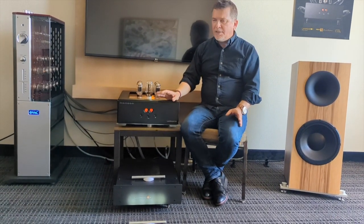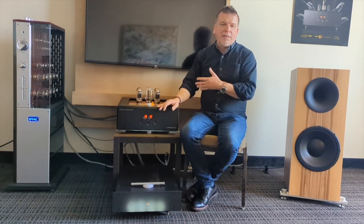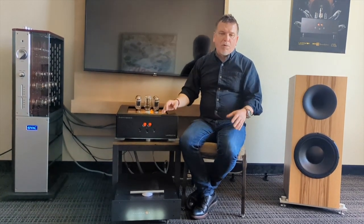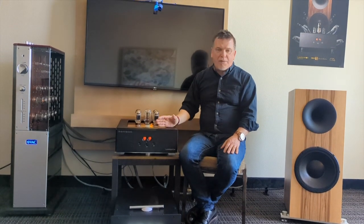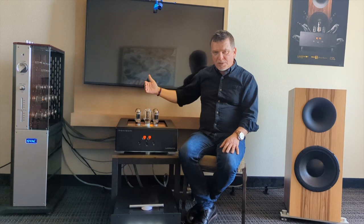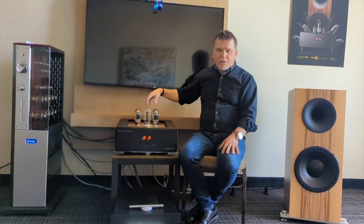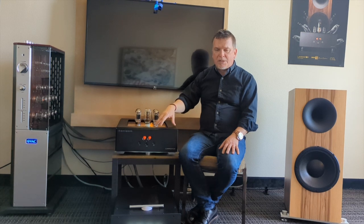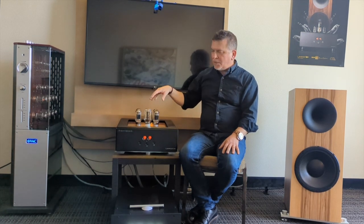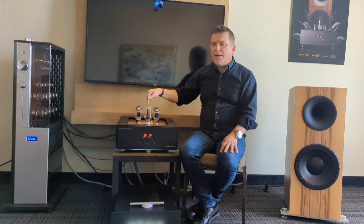So practically having this DAC allows you to use just power amps and not worry about anything else, because any device known by us used in the entertainment business can be connected and enjoyed with the same quality. There is one thing worth mentioning: if you use line level sources of analog type, the tubes will not be involved, only the volume control section. The tubes are not required. The tubes are only used for amplifying the internal DAC signal, which is very, very weak.